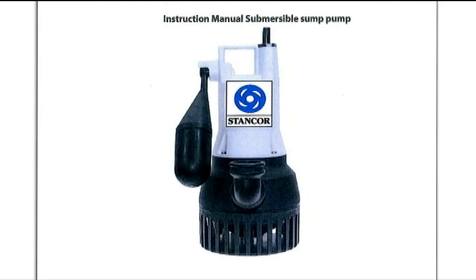The pump has a strainer. If you find the pump is clogging on the strainer, you can take the strainer off — the O&M shows how — so it can pass bigger solids. But then you risk clogging the impeller instead of the outside of the strainer. Also, this pump is 480-volt, three-phase, and it's wired into a Hubble switch and an HOA control device for start-stop operation on this sump.